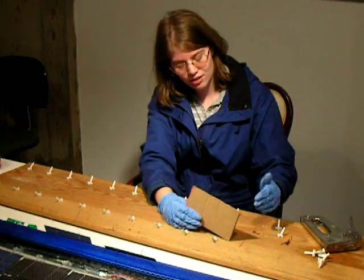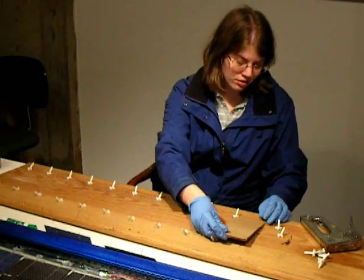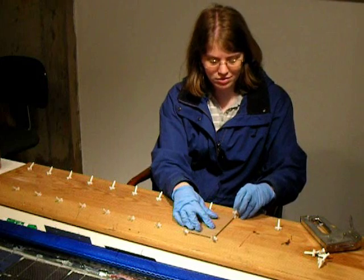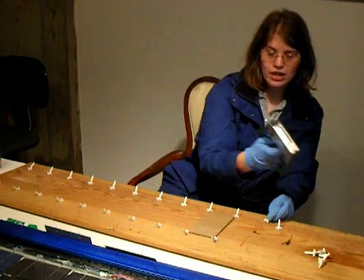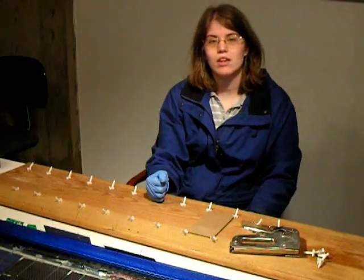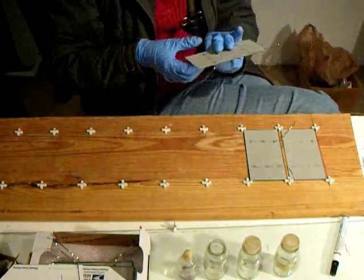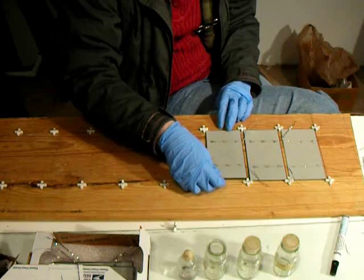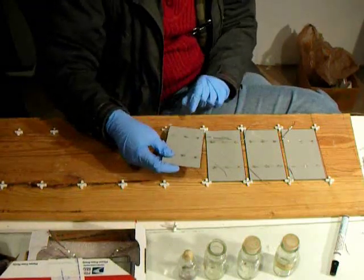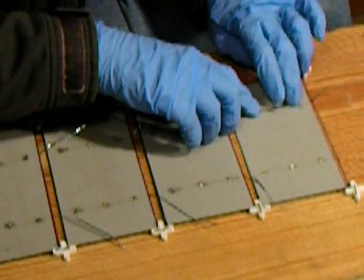Make sure your jig is square — you always want a perfectly straight line to align the cardboard pieces. Simply put your cardboard jig down and align your tile spacers on the corners, then secure each tile spacer with a heavy-duty stapler. Be as precise as possible because if you solder the joints uneven, you will not be able to fit them properly on your finished product. Lay nine panels blue side down in the jig, with the negative leads from the front arranged so they sit on top of the white squares on the back of the panel.